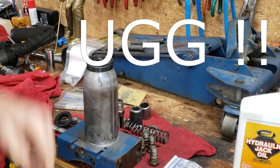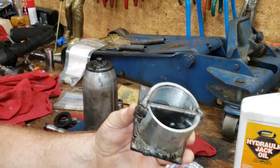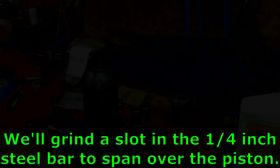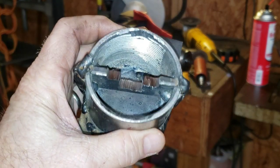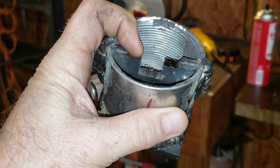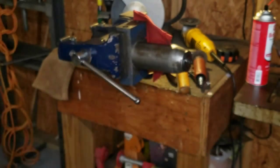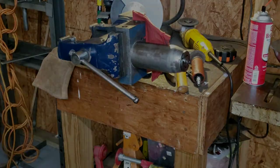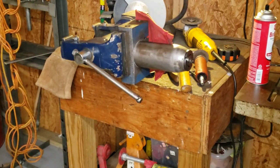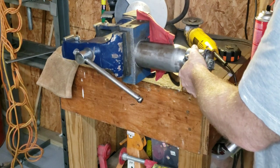That won't work with the piston in place — our fancy tool won't work. I designed that with the piston removed, so it's definitely a unique tool for very specific circumstances. We're back with a little modification to our original tool to accommodate the tip of the piston where the cotter pin goes in. These top edges are what grab in the gland nut to tighten or loosen it. We had to get our 15/16 inch socket — I don't have a 15/16 inch impact socket and I'm not going to go buy one. We're going to crank down on this as much as the impact will go.